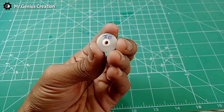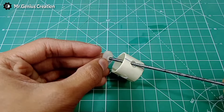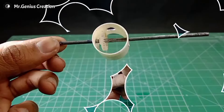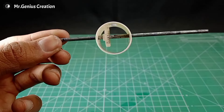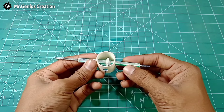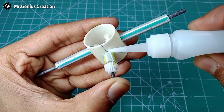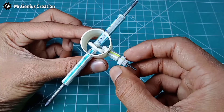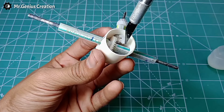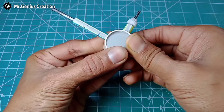Here we will put the axle. This is a crown gear with 30 teeth — the crown gear is on the side of the tooth and is able to transfer motion from the vertical axle to the horizontal axle. Then we will put two pieces of pen on the axle and fix them. We will put super glue on all pen pieces. We will also apply petroleum jelly to reduce friction. The gearbox assembly will then be placed onto the PVC chassis with super glue.